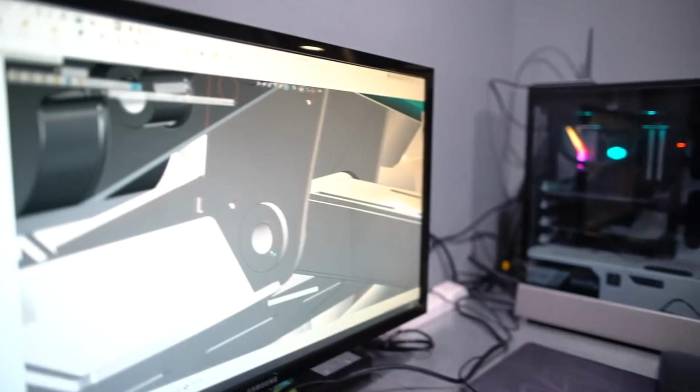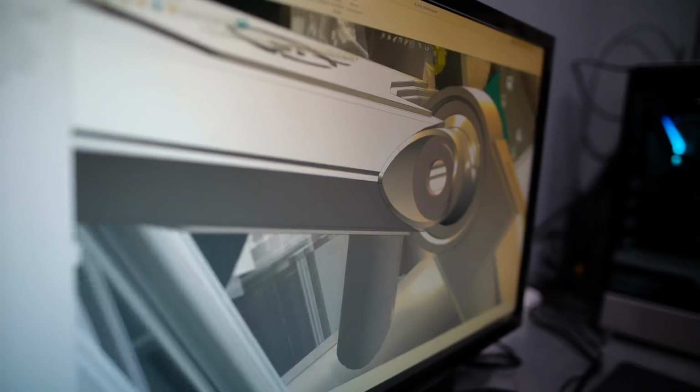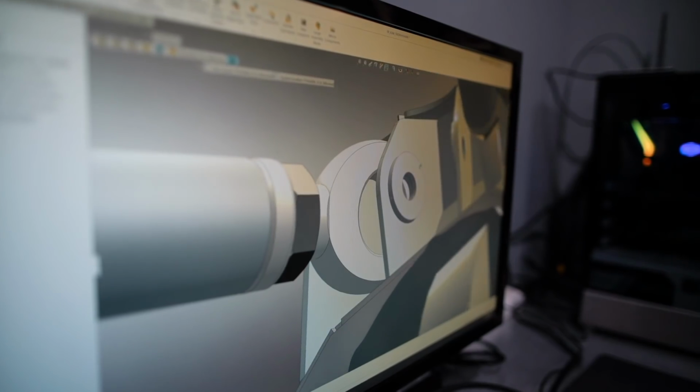We have weld washers, where weld washers need to be placed on those high impact pivot points. A weld washer is basically something that welds to the outside of the tab, and it creates a lot more thickness there for the tab to prevent itself from ovaling out, time and time again, on cars that see heavy abuse, older cars that aren't shanked properly with the right bolts. You just see those start to oval out. So weld washers, as you can see on the drawing, are placed in many spots where there's going to be a lot of load as it's cycling. Pretty much all the suspension pivots are mandatory, and then some of the select shock pivots as well.